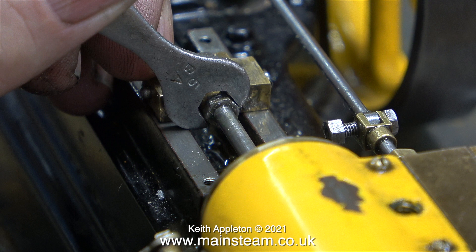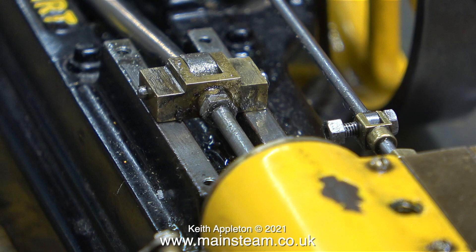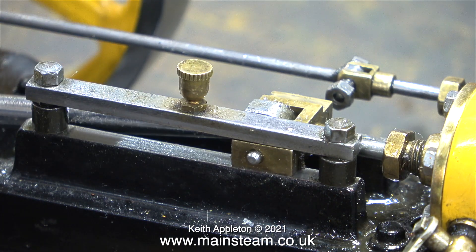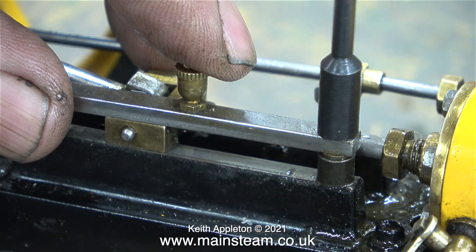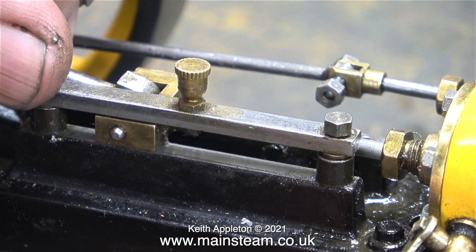I've refitted the lock nut and here I'm just locking the piston rod against the crosshead without exerting excessive pressure on the parts. If you look at these crosshead guides you will see two things that are wrong: the spacers are too wide and look stupid, and they are too short because when you tighten the bolts everything locks solid. I intend to make four new spacers that are the perfect length for the job. Temporarily though, I'm just inserting washers so I can test the engine.